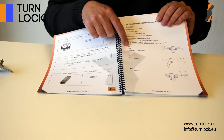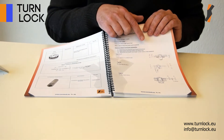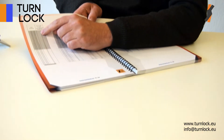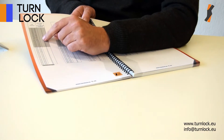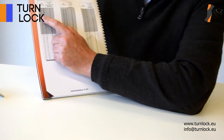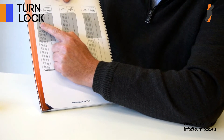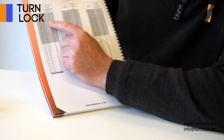For type A, use the corresponding formula. Typically it is your upper panel thickness plus your frame thickness, which gives your total thickness. Using that total thickness, go to your receptacle type — we selected type A — and imagine you arrive at 5mm total thickness. That falls in the range between 4.6 and 5.35, which means you need to select stud length number 6.